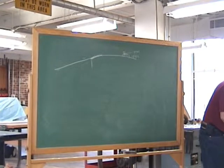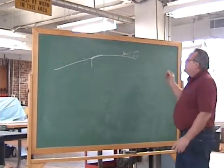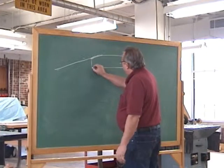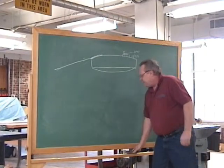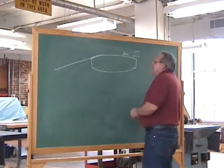So the question is, what's going to yield this type of geometry and how to achieve it? What I do is I radius the sides. Of course, we all radius the back. 16 foot is standard for Martin, I think, 15. Guys are doing different things. But I also radius the top.